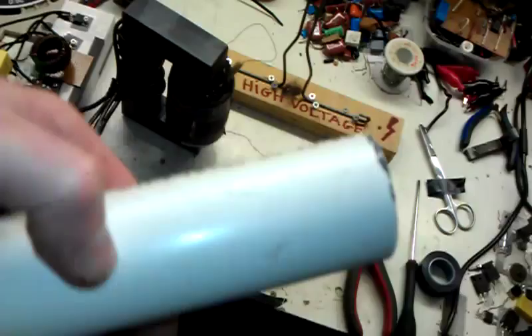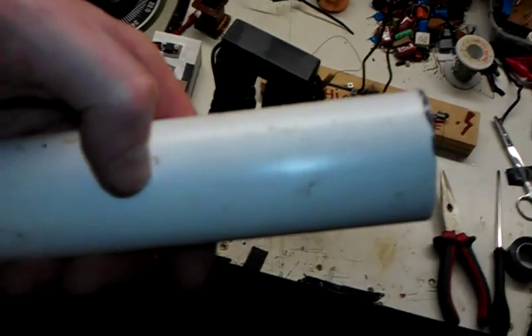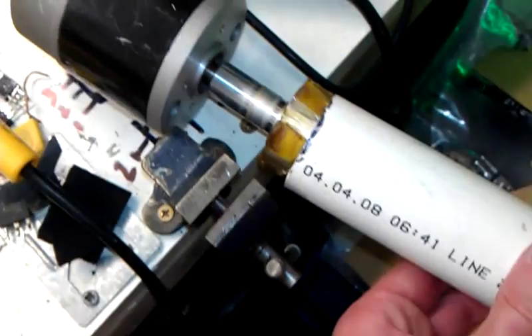See this piece — this is an ordinary sink drain part, from a sink or bath or whatever. What I did is I cut a piece off, about three and a half inches, and stuck it on the end of this motor, forced it all the way on. Then I used my variac to slowly turn the motor around as I slowly fed wire onto it from that big reel.